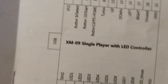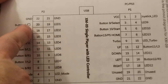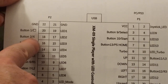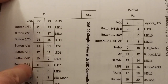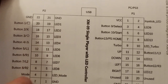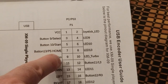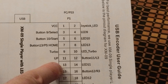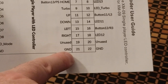Now, here's a guide to the encoder, and each of those wires, like this one, goes to the square button on a PS2 controller or 3, and that goes to X or cross, O, triangle, and then L1, R1, L2, R2. You've even got a mode button, which I might explain a little later, or maybe in the description. We've got the select, the start, the home button, and I'm not going to do anything with turbo. You've got up, down, left, right, and ground would be right here, the final one.